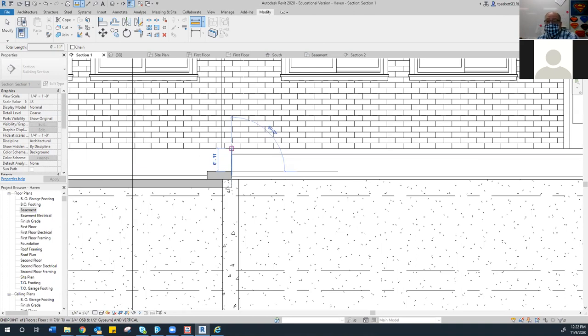So again, it comes down to what would you like to see me do? I can do this with stacking 4-inch units, which is typically what would happen here, is we'd have some 4-inch pavers. They'd stack and make the steps at this point. Or we can, in this case, actually make a stair and do a stair here. Which would you like to do? Because my total height here, if I'm really getting into that and getting serious about it, from the foundation to the floor is almost 1'4". So I could do steps. What would you guys like to see?